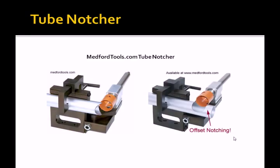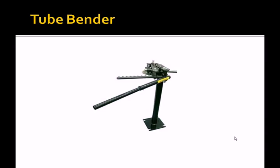A tubing bender. It's possible to bend pipe by hand if the pipe is long, but you're looking for something with much more accuracy that will work on already cut, short tubing. It needs to be something specifically designed to bend tubing, not pipes. Benders designed for plumbing pipes based around a bottle jack aren't much good because they won't allow tight enough bends — you'll need to bend around a radius of three to five inches. A good tubing bender will be around $500, and with $1,000 you should be able to get a really good hydraulic tube bender.